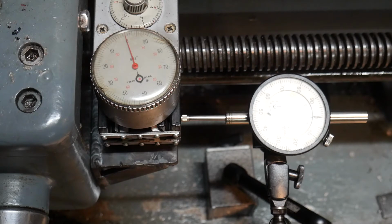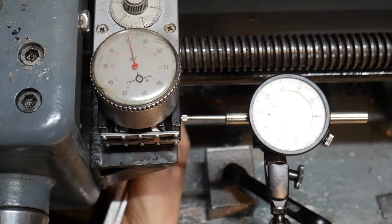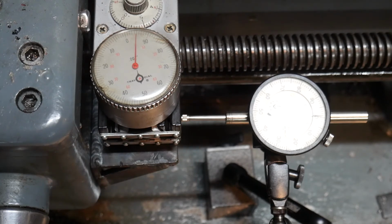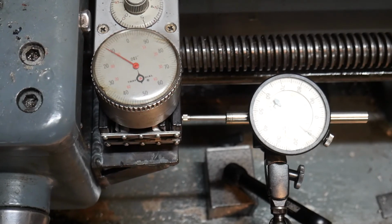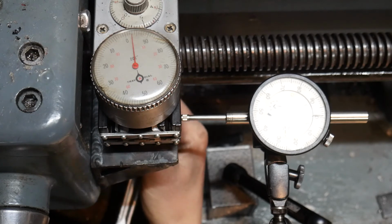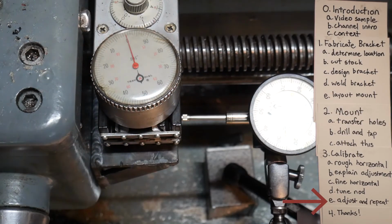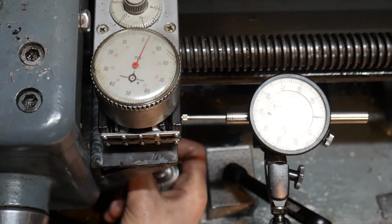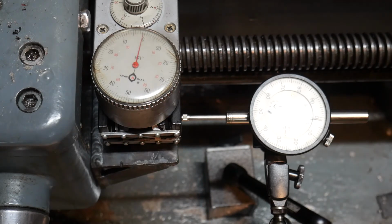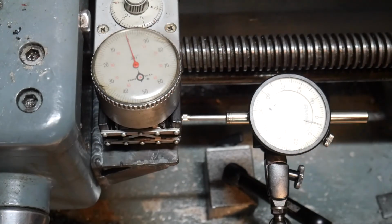So because it's reading too high, I tip it chin down forward. So I tighten this by about 1/6 of a turn. I loosen that by about 4. Well, let's try again. 1/6 of a turn. I'm gonna go a lot more. Yeah, this thing needs to be backed off just a little. It's too tight. We're gonna have to do all of our calibrations over, but whatever.